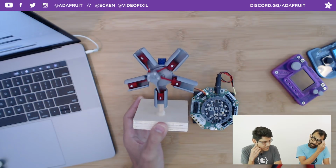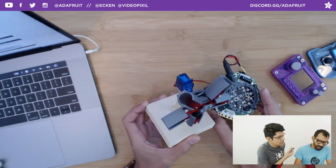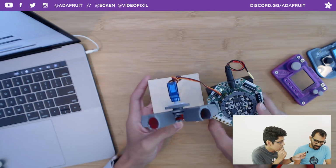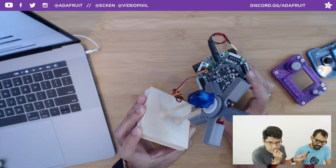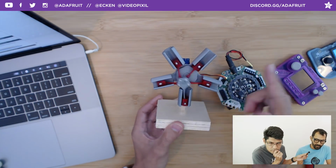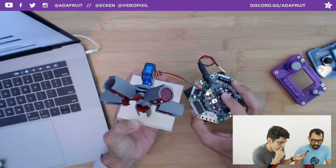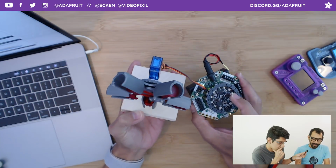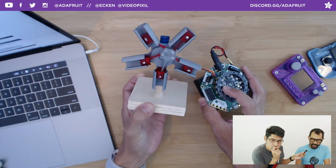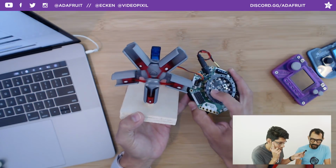Sweet. So it's a simple model, usually used on airplanes, I believe, as everybody in the comments is saying. And we're just using a little servo on the back that's actuating this whole little thing here. It's making the little pistons rotate. So we're just using a Circuit Playground Express on top of that. And I'm just using MakeCode to have it go either negative or positive direction. And that's all it really is. I'm just using the A and B buttons for that.